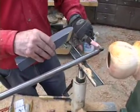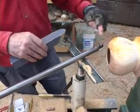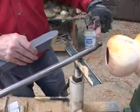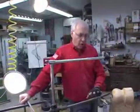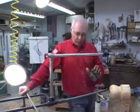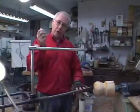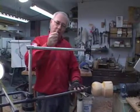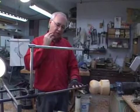So that's what I was doing here. I was using this broad brush of that to clean up the inside and therefore get rid of all those tool marks. And it's a patience thing. Take it slow, do the pace across the surface slow, and use that wide, broad brush of the sharpened edge. If you can make that first cut or that last cut across the bottom really nice and clean, then you don't have to sand so much.